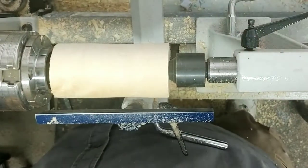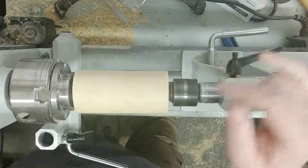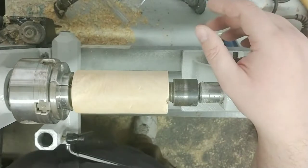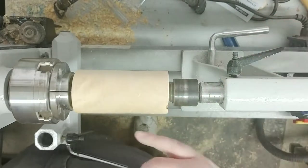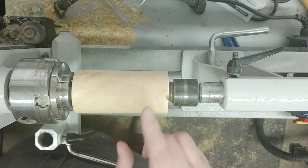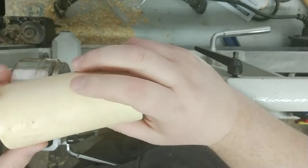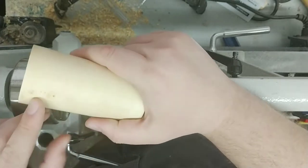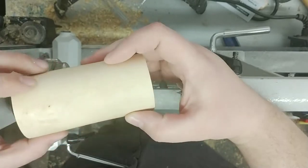I'll clean that up with some sandpaper. I got that all sanded up to about 320 grit and I've still got some scratches here, but I'm not too worried about those. I found that this was all end grain here and end grain on this side — the way that I had cut it, it was hard to tell once I got it down into different forms which was end grain. With as light as this was and all the bandsaw marks, we'll live with that. I'm going to shorten this up because with how thin this is, this is going to be a kind of funny-looking jewelry box. I need to do my offset first. I want to save this end — I've got the most burling on here and you can actually see the burl comes all the way through the top. I've got to get rid of the spike hole, so I'm going to lose about to there. I think I'll mark my offset point right about there.